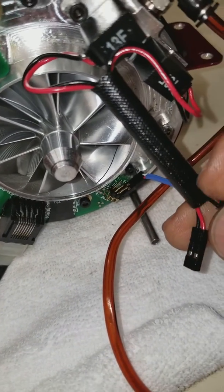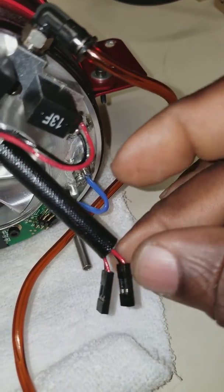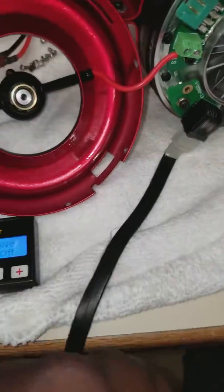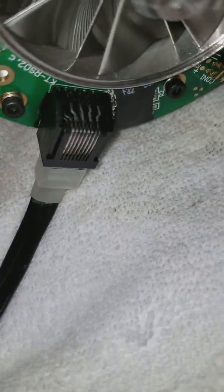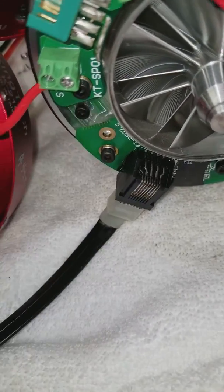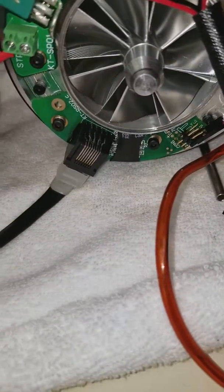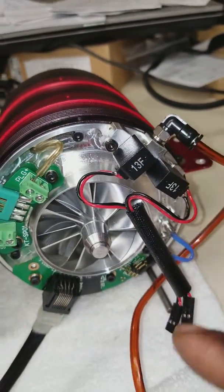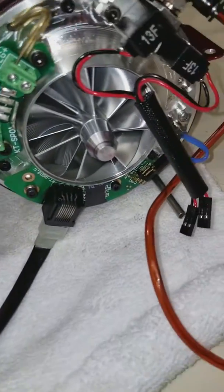So this one is the gas and this one is the fuel. You can put five volts — not exceeding five volts — so you can use a five-volt voltage regulator or whatever it is to connect to these connectors, or you could connect it directly to your ECU, which is right here. This cable here is what carries the voltage to your solenoid — the RJ45 connector. I actually put a new one on there because the old one was not working properly. If you're handy, you can cut your cable off and repair it. If both valves are working, chances are your problem is in your RJ connector or the cable coming from the ECU.